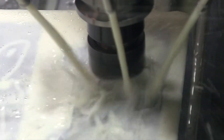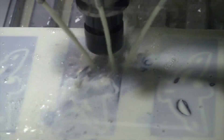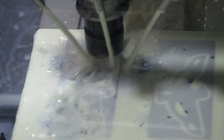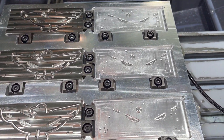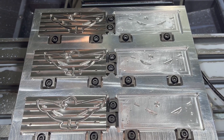About a two-and-a-half minute operation and we got all three of those bored back out again. The pallet blows off pretty easy so I'll dry that a bit more, pull these off, swap the pallet back for the vise, change the offset, and we're ready to go back on the backside. Let's check it out.